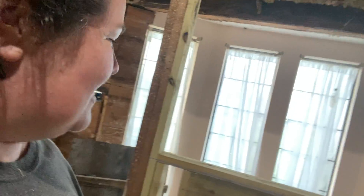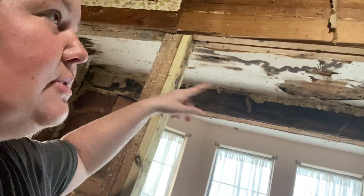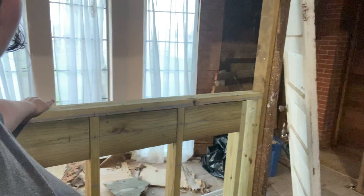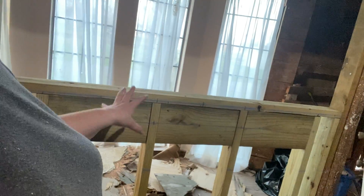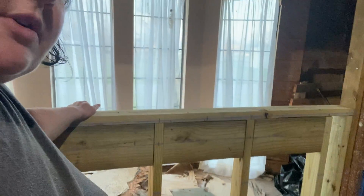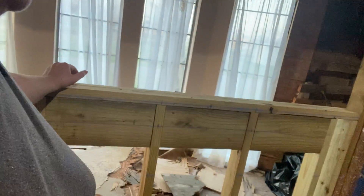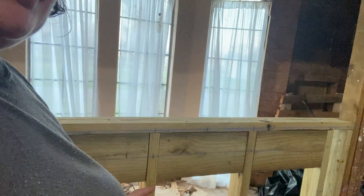That's what the noise is - kind of an interesting view as the day has progressed. This wall was not here earlier if you recall, and this structure has been beefed up again - this is what was there and it actually supports the headers. I'm excited to have all of that back in place, nice and solid. We've also put blocking in. Blocking adds a little bit of structural stability for the wall itself, but it also allows you to put fasteners in where they need to be, because sometimes you're not going to hit a stud no matter what you do.